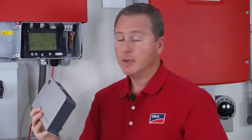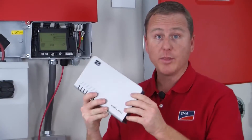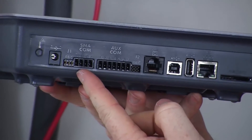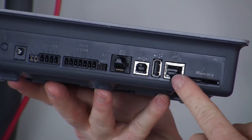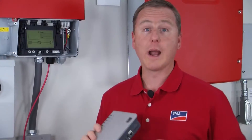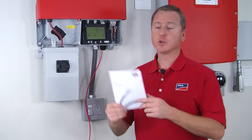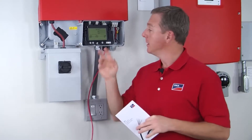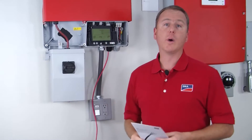All I'm going to do is take the other end of this wire, connect it to a male adapter that comes with the WebBox, and then plug that adapter onto the bottom of the WebBox. The only thing left to do is connect the WebBox to the customer's router and that's it. Included with the RS-485 module is a cabling plan that outlines different ways to connect the inverter to the WebBox.